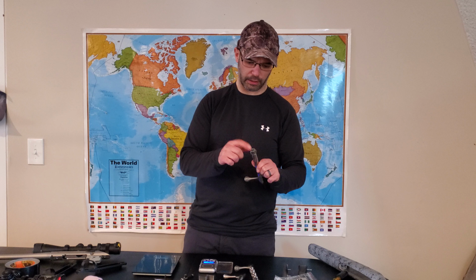Another significant savings is going to come out of your bolt. So this is a factory bolt. This is for the short action. Factory bolt's weighing in at about 11.3 ounces. And I would say this also applies to the medium action diameter bolt. So this would do your 6.5 Creedmoors, your everything but your Magnum, and it would be different compared to your 223 sized chamber bolts. Anyways, this one, like I said, the factory at 11.4, this modified bolt at 7.6.